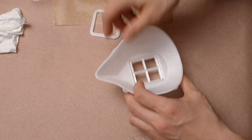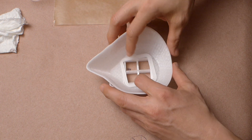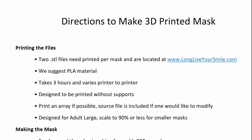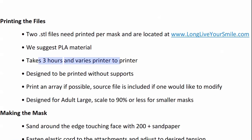So I've modified the design with a flange to hold the filter into place. The reason the original design didn't have that is that it would require the 3D print to have supports, which is an area they didn't want to do — it would increase the print time and also a lot of the post-production, since supports always have some post-production.